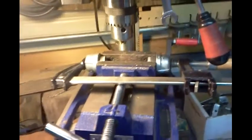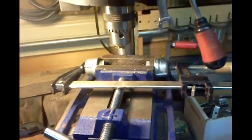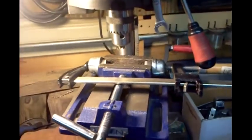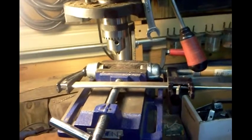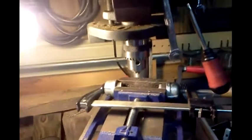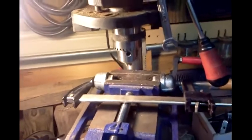Now I'm going to drill my 1/4-inch drilling tap for 1/4-20. And the bolt head will stick out a little bit. I didn't think to buy any damn Allen set screws, and I might look to see if I have some, but probably going to go with just 1/4-20. And might have some cap screws like an Allen screw. Anyway, get back with y'all in a little bit.